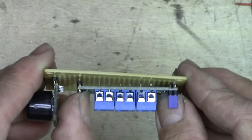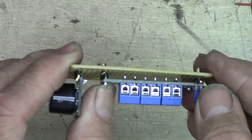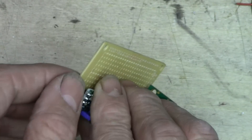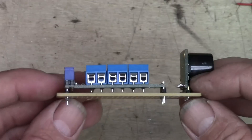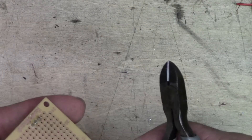It sits a little bit high on one end because of the offset of the pins, but I managed to squish them through a little bit further so it sits down more tight to the board. Now I need to clip all these header pins back because I don't need them poking through — this is going to be the bottom of the robot, and I don't want anything catching on anything while it's driving around.